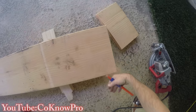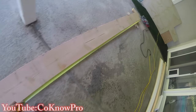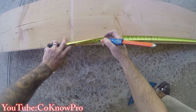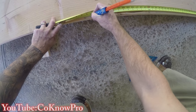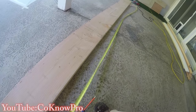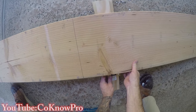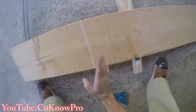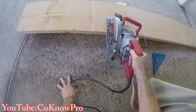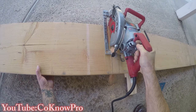I'm double-checking my measurement here. I cut off that rough end and now I have a clean edge to pull my measurement from. I wrote it down — 13 feet and 3 eighths. I took a speed square and a framing square and scribed my line. I put a support behind my cut so that when I make the cut, the waste piece drops off. We got that cut and everything looks nice.